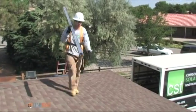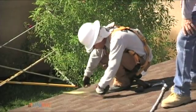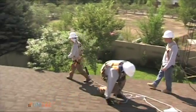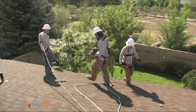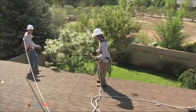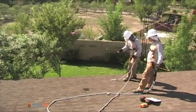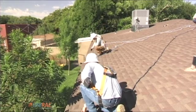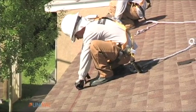We're on the roof now, locating the array installation area. We want to ensure optimum efficiency and minimize any adjustment at the end. An installer doesn't want to drill any more holes in the customer's roof than he has to. Finding the center of the installation area, positioning the array accordingly, and making sure the mounting structure is square is part of the process. Coordinating with the roof truss locations once we find them, the mounting structure attachment points are the next part of this process.